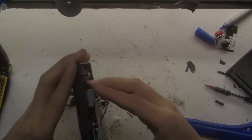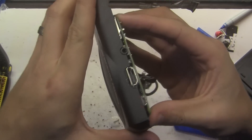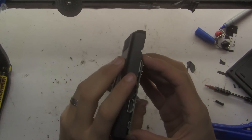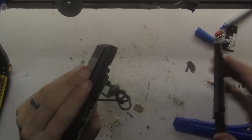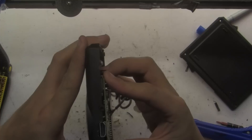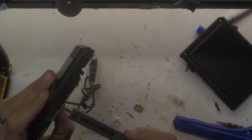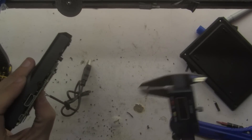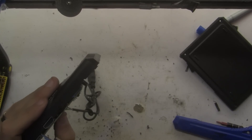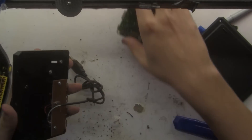Test fit looks good now — it's a little bit ugly but you're not really going to see it anyway. Now let's take a look at the micro USB — you can see it marked there. It's just below the edge so I'm not going to bother touching the top part of the case, I'll just cut the bottom part. I also have to cut the bottom part a little bit for the HDMI, so I'll measure how much I need — that's 2mm for the HDMI and almost 3mm for the micro USB power.